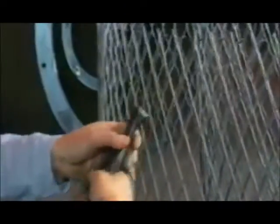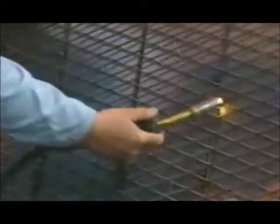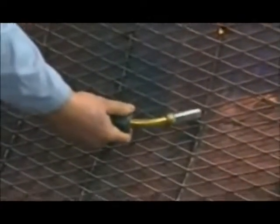The reinforcing net is welded to the base such that the Densit material can enclose it. The reinforcing net must be so placed that about 2/3 of the wear lining can be placed above the net. With a 40 millimeter thick wear lining, the distance from the net to the base will be about 10 millimeters. With a 30 millimeter thick lining, a distance of 5 to 6 millimeters is to be preferred.